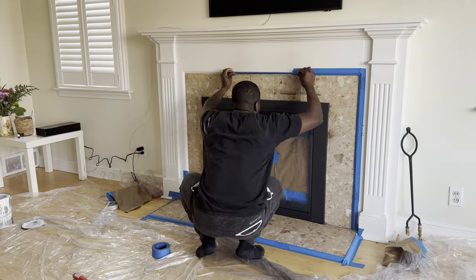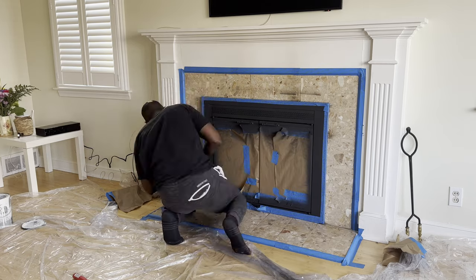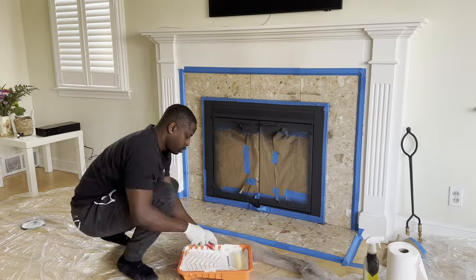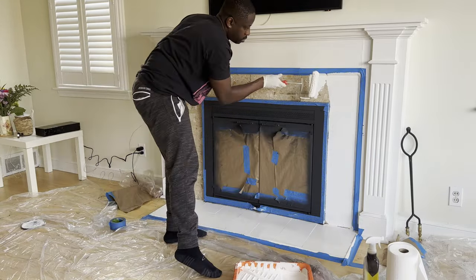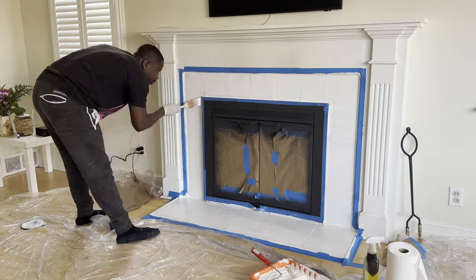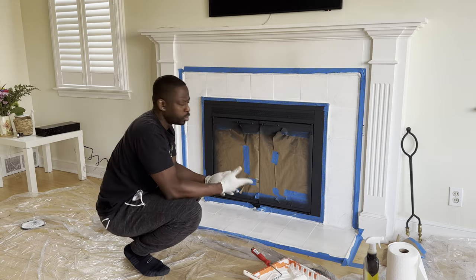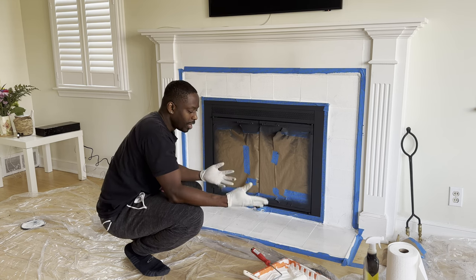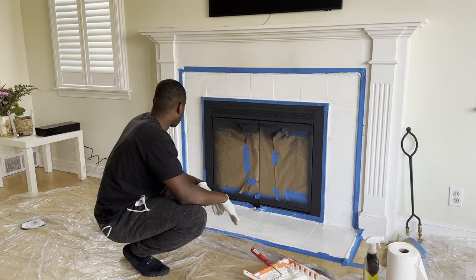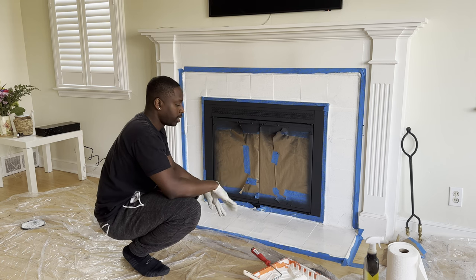It takes maybe about four hours before a top-level coat, so I might not get to it today — we'll just come back tomorrow. Let's prep, which means just putting some tape down, and let's get to painting. So we have the first coat of the primer. I'm going to do two coats just because when using a roller and a brush you can definitely miss some areas. We're going to let that sit maybe an hour or two, do a second coat, and let it sit overnight.